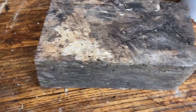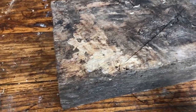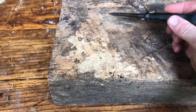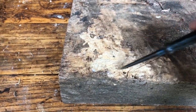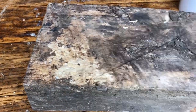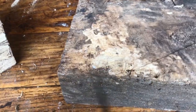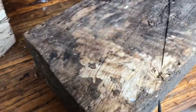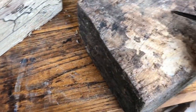Here is a piece of oak that I've gotten, and this is basically all heartwood. Oak spalts out on the sapwood extremely fast — it can go in three months and the sapwood is spalted while the heartwood is basically untouched. I picked this out of my firewood pile because I could see what looks like a little bit of figure in here, and you're starting to get what looks like some white rot coming in. This is all extremely dense, so it would take quite a while for the spalting to work into this heartwood. There might be some staining in there, but I really wouldn't expect a whole lot — it probably hasn't gone very deep.